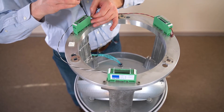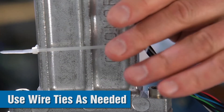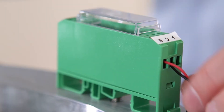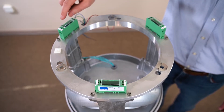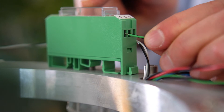Make sure that the wires are not coming in contact with the bucket or the support dish, as this may have an effect on your readings. Sensor number one at the northernmost point will be wired to this transient arrestor. Sensor number two here will be wired to this transient arrestor. Sensor number three here will be wired to this transient arrestor. Pins five and three are the output signals.